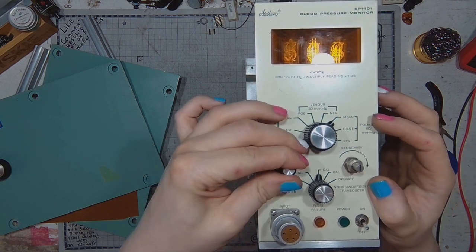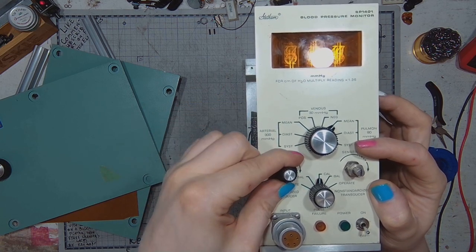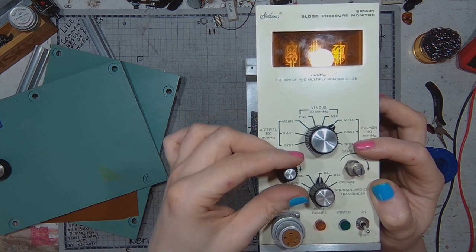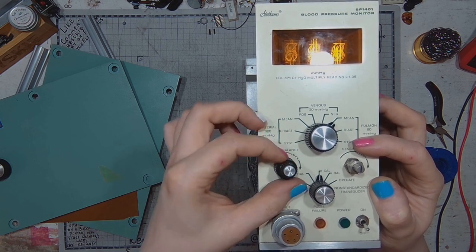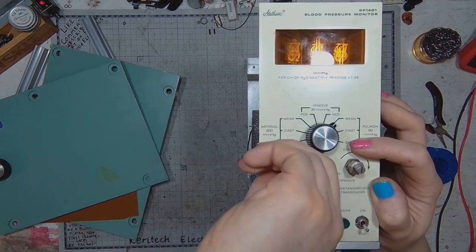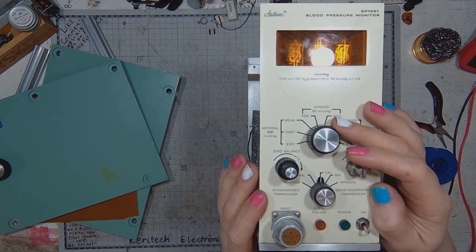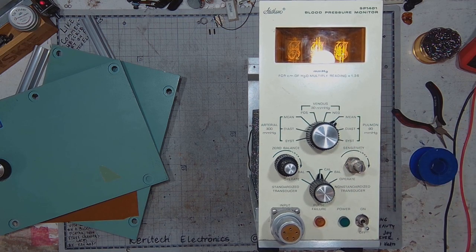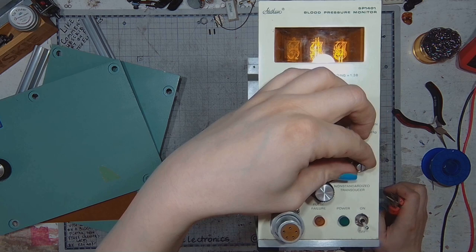And if we take a look at the potentiometers, this is a lockable potentiometer, the outer nut is for locking the pot, the arbor, and only when it is unlocked you can rotate it. When it is fully locked, it won't budge. So this is for stabilizing the position against accidental throwing it out of adjustment.